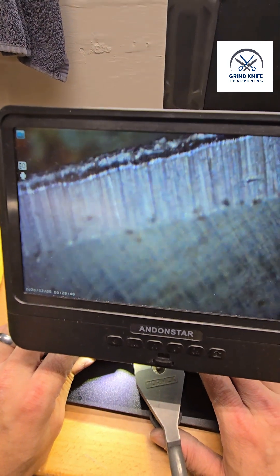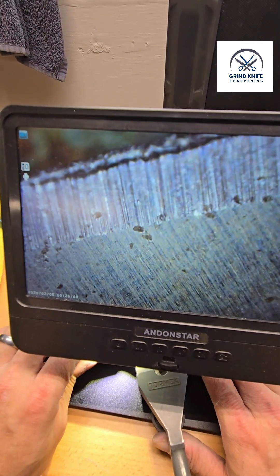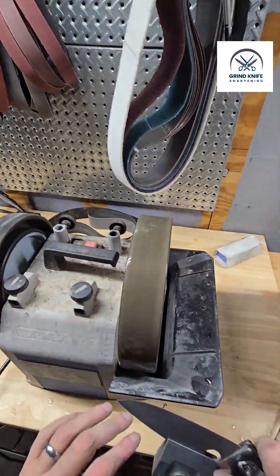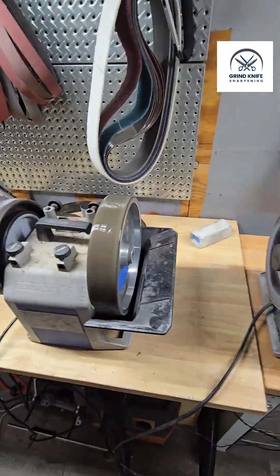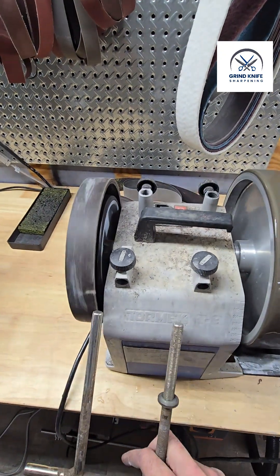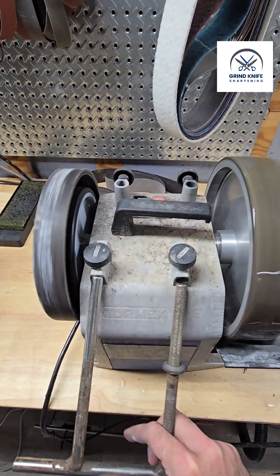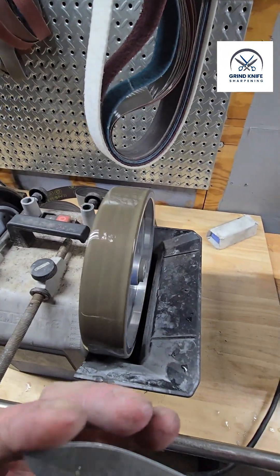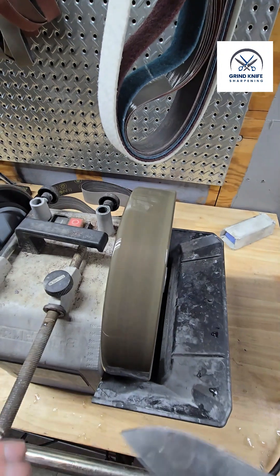We're going to take care of that. We've got our solid bevel line, 100 grit scratches — all of that. We're going to see again how far we can go. We're going to start off on our 1000 grit wheel and just do three quick passes at Tormek speed, because I'm trying to nail down for you exactly how much it takes to remove those scratches.